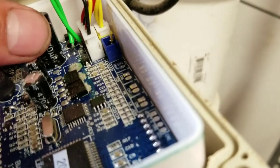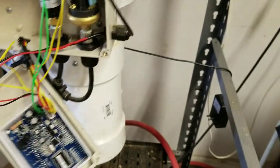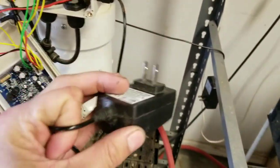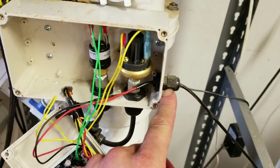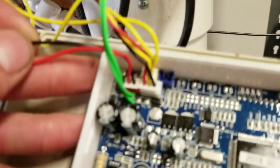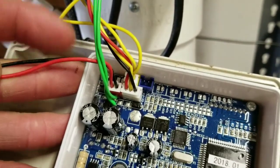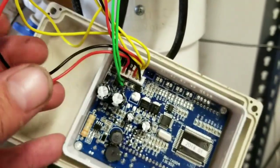I actually found it's better to also put a little bit of hot glue or RTV around it because they like to wiggle loose. For wiring the power in, you have your inverter, your DC power supply. You're going to use one of the small gland nuts or cable nuts — whatever they're called — strip it back, and then that goes to the wires right there. Those two with the double pole plug, that's your power supply.